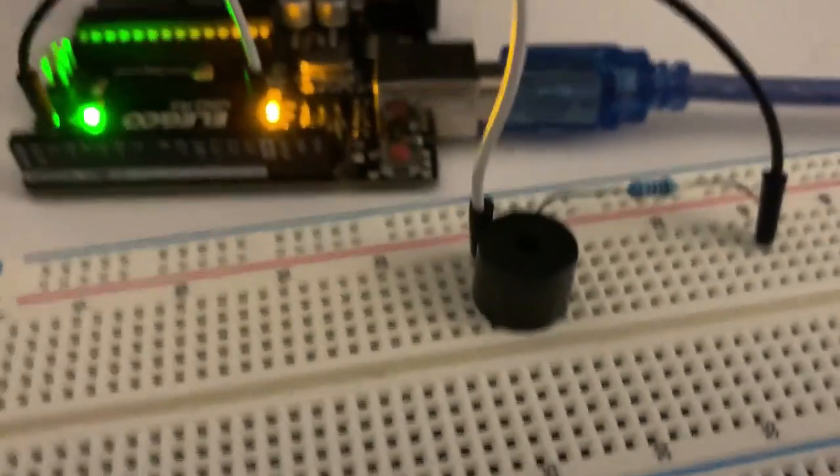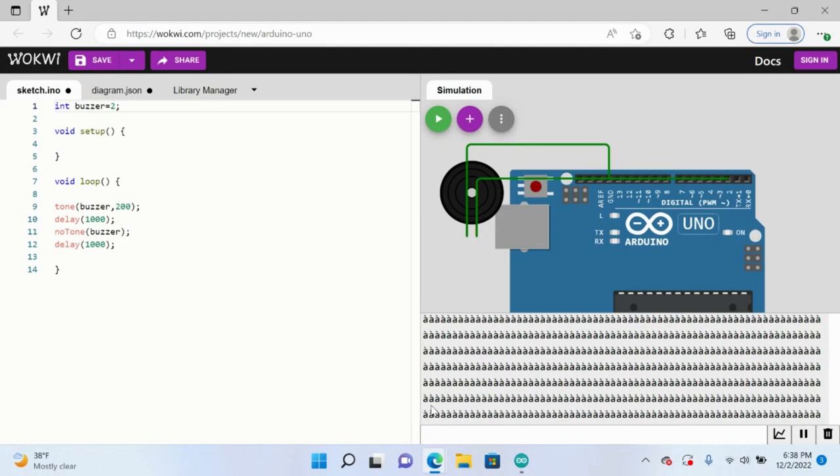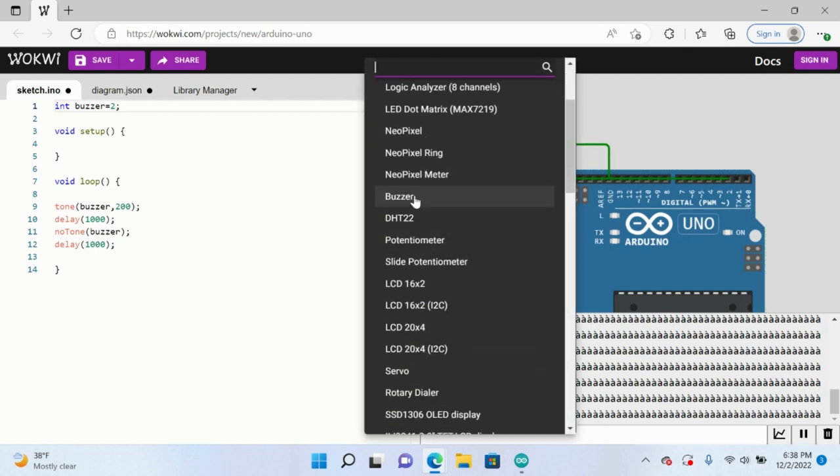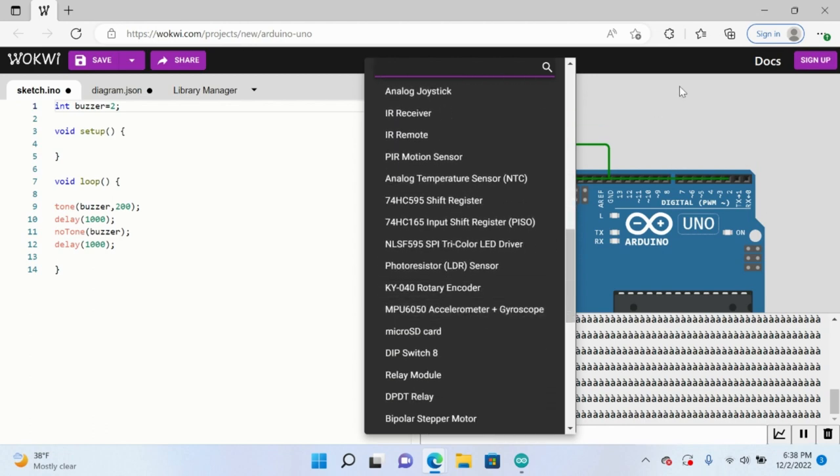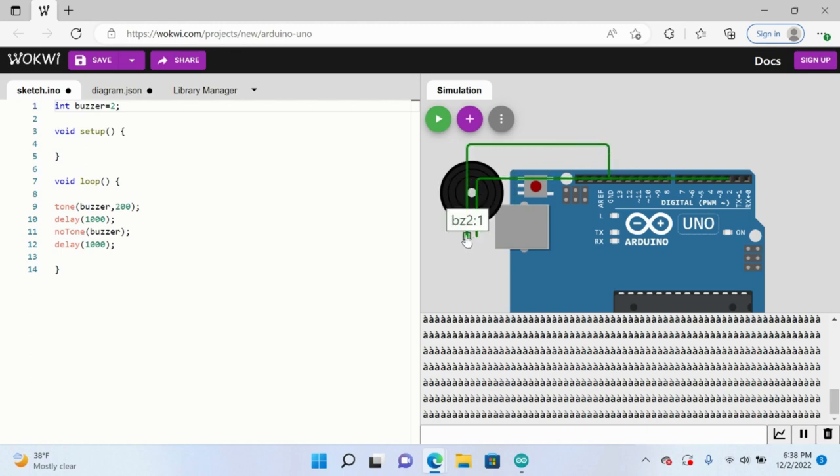So now let's go online to the code and the online wiring diagram. Let's take a look at the code and an actual visual representation of the Arduino. This is a really great site that I recommend — I guess it's pronounced Wokwi. It's a real demonstration of what an Arduino looks like and the gadgets you can use with it. So we can go here and you see the buzzer, the servo, the LEDs, the analog joystick — all things we're going to get into in future videos. But for now, we're just going to be using the buzzer. The negative or shorter side connects to ground, and the positive or longer side connects to a resistor, and then that resistor connects to pin two. That's very important — we connected the buzzer to the second pin on the Arduino.